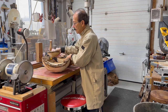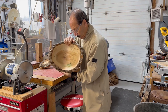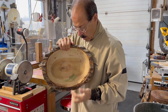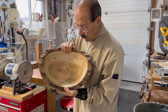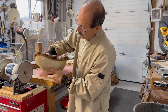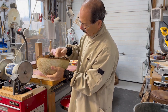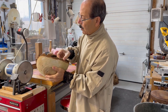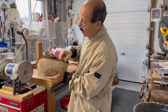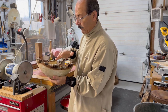The trouble is the bark has actually separated in a few spots. In these areas I've put some CA glue and walnut dust in there to try to fill the cracks. On this one, almost half of the bark on the entire surface is coming off. So what I might do with this one, and the same thing with the small one, is cut it and then re-glue the bark right back onto the piece before I rough turn these.